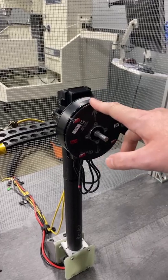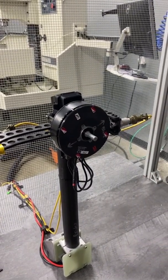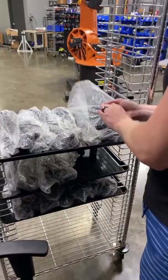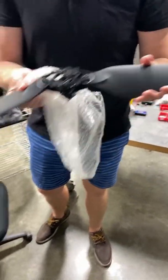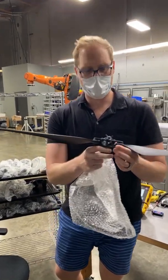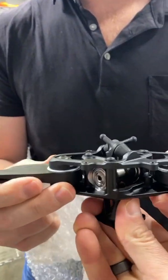I think it was about a 10x reduction in vibration, so it made a big difference. If you've ever built custom drones, you know that once you start getting really big prop assemblies like this — these are 33-inch props — the vibrations can get huge. That's a lot of what led us to design and innovate the active blade assembly, as well as implement this last step of dynamically balancing the rotor head.